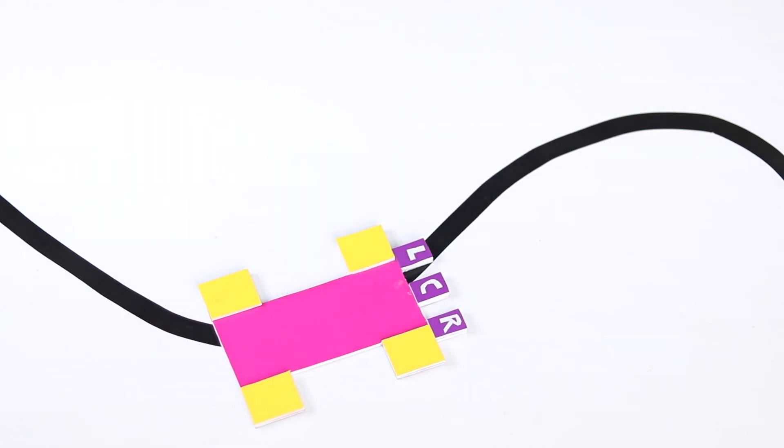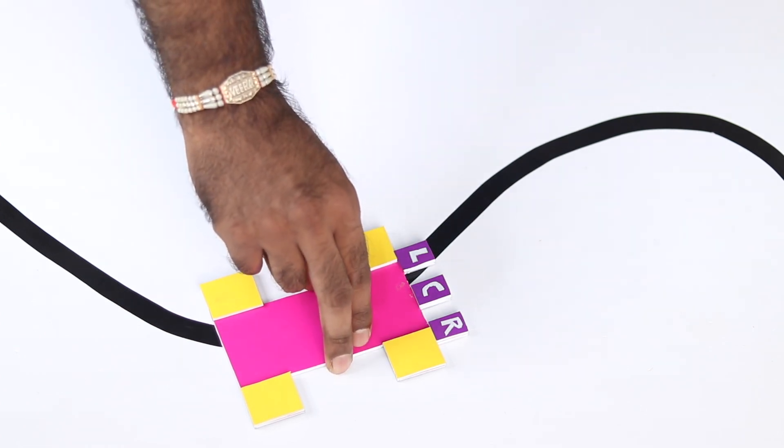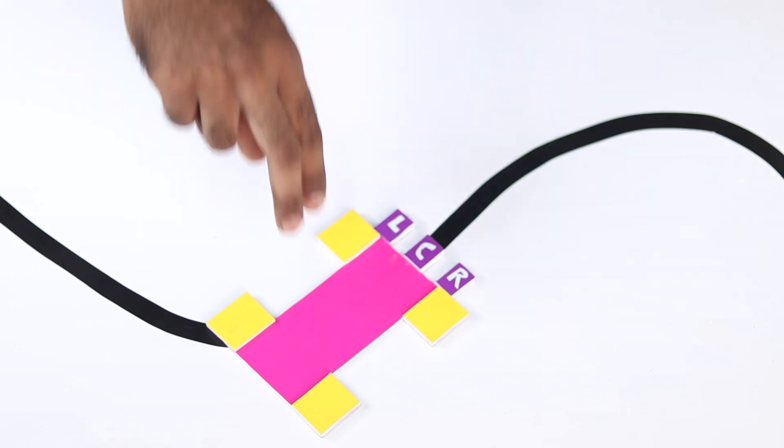But the moment this robot moves forward, the left sensor will say no, and the center sensor will also say no. Because the left sensor says yes when it was on the white patch, and the center sensor says yes when it was on the black patch. But this is not happening. So in this scenario, these two motors turn off. Because of this, this entire setup slowly turns.